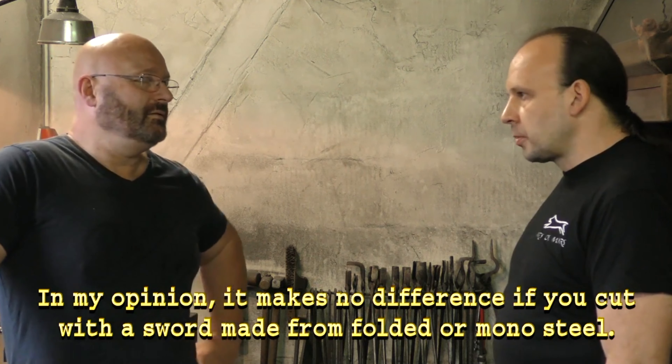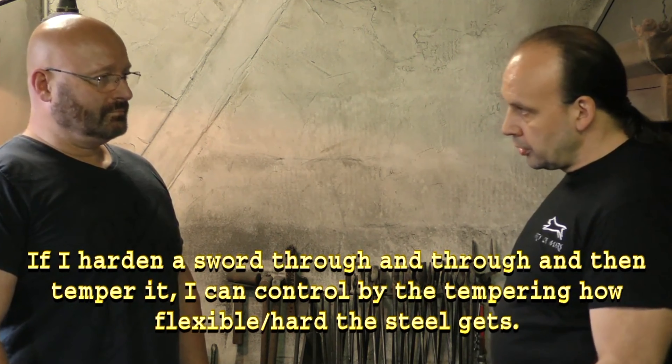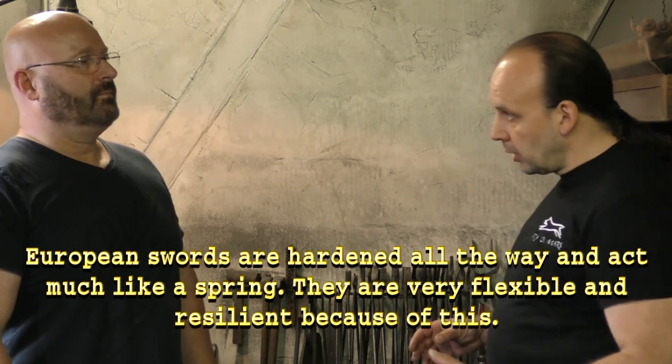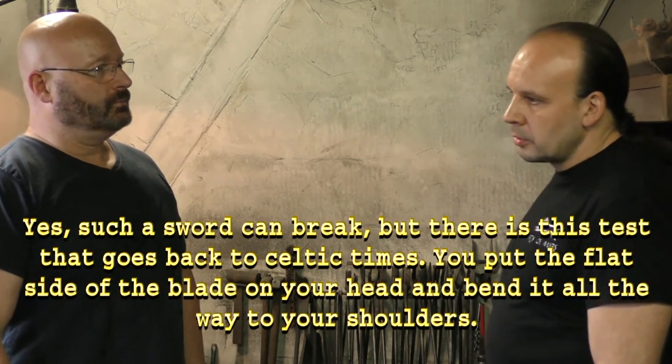As they say, a good thing becomes impossible if people begin to live in comfort. In the middle of the Edo period, harder mass-production Tamahagane appeared with improvement of the Tatara. Did this contribute to improvement in performance and blade beauty? Reality was reversed. Compared with the Koto, testimony from polishers, martial artists, and battlefield verification proved that the performance and beauty of a blade were clearly retreating. A sword is still below the level of a Koto, and the Tamahagane myth obscures this. As long as hard Tamahagane of uniform mass production is used, one-piece forging is inferior — therefore the laminate construction of hard and soft steel was devised.